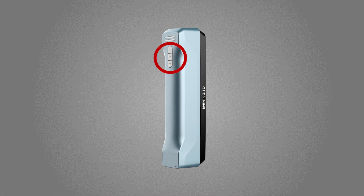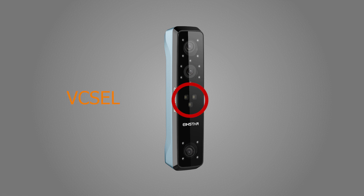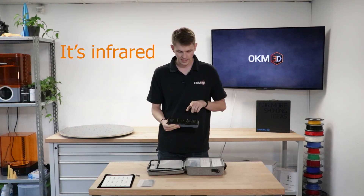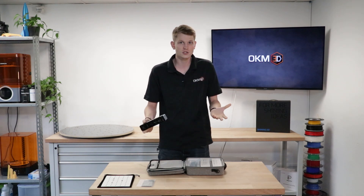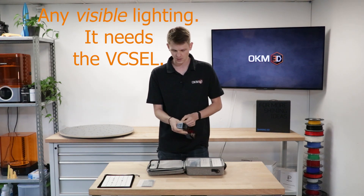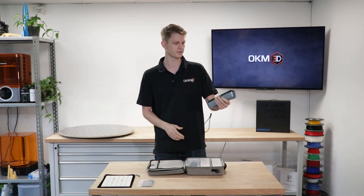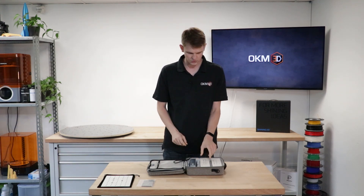It does rest very nicely in your hand. It still has three control buttons near the top. On the front it has two stereo depth cameras. There's also an RGB camera for capturing texture and color, and VCSEL projectors to project light onto the part. This is invisible light — you can't actually see it. For the color camera to work, it activates white LEDs around that camera, but regular scanning doesn't need any lighting from the scanner itself. At the bottom there is a single plug for connecting to the PC.